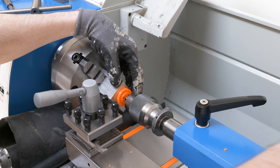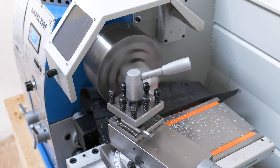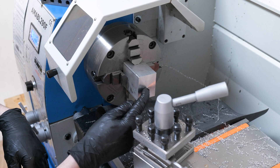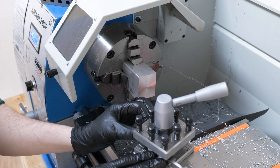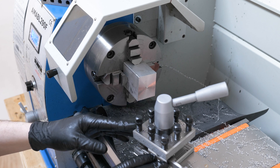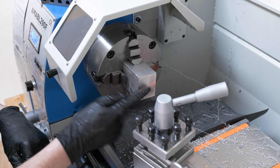That's another little thing I love about 3D printers — you can just quickly 3D print a little jig like that to help save some time. As you can see, I do not have my tool set to the correct height because I've got a little bit of a dimple left over. You don't even want to see how I'm shimming these up — I've got a bit of steel and about 20 cut-offs of shim stock plus some washers to try and raise it up. I cannot wait to get the multi-fix to stop having to do this. But we've got it faced and we will just turn this down to the 35mm required.